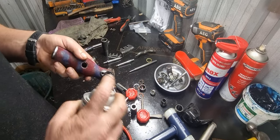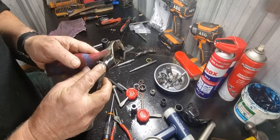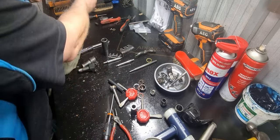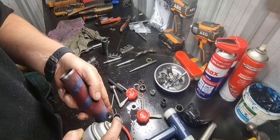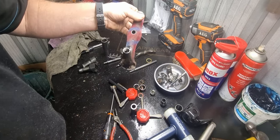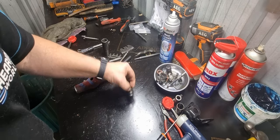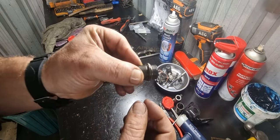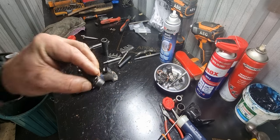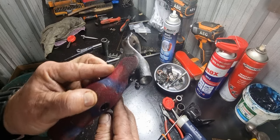Now I'm cleaning the barrel. In here we've got to get rid of all this oily residue so we can put the tension nut bushing screw back in and Loctite it. If it's too oily the Loctite won't take. What we use is brake cleaner - just cheap brake cleaner - because it dries with no residue and gets rid of oily surfaces. Give it a rag, let that dry - it dries within 30 seconds and eats away all the residue. You can see the thread is quite dry now, the brake cleaner has done its thing.